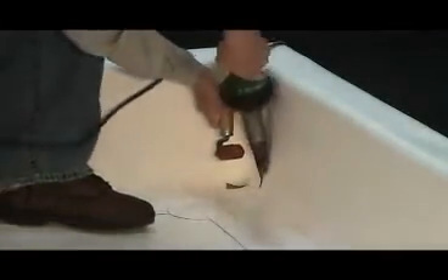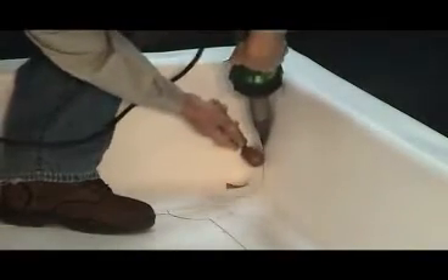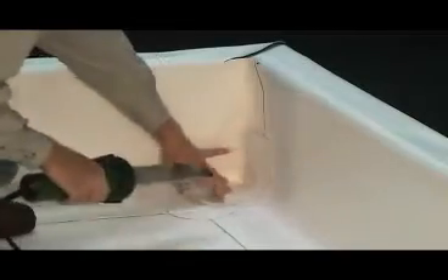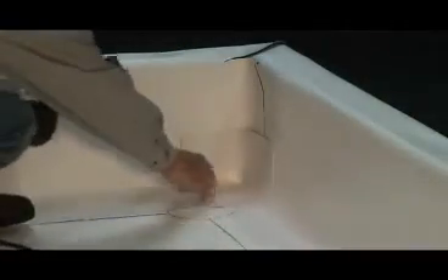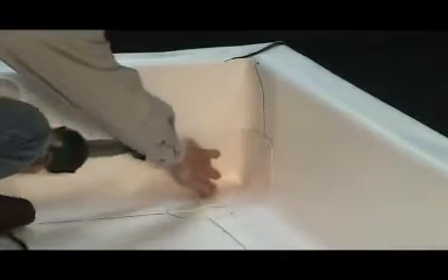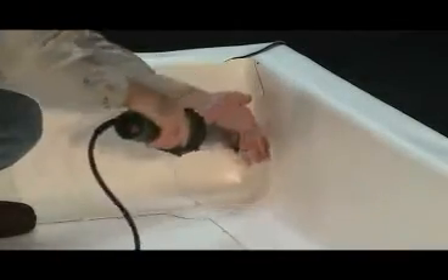In the bottom inside corner, we will be installing an IB non-reinforced prefabricated factory corner. Simply tack weld into place, avoiding bridging in the turn-ups, and be sure to weld all turn-ups first. Then weld the remaining perimeter edge.